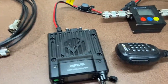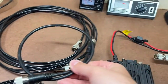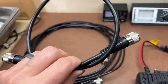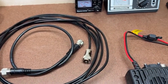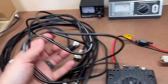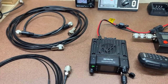As a baseline, I'm going to hook the radio directly with just a coax union so we have pretty much no loss. Additionally, I have this RG8X, which is a little bit thicker and less lossy than the RG58U. I also have some CB cables — a 9-foot RG58U cable that came with a CB antenna kit — so I'll try that as well. We'll compare all these coax cables.